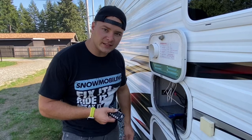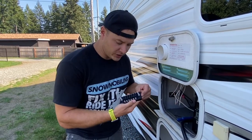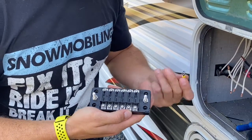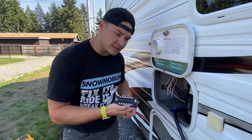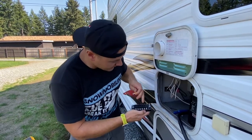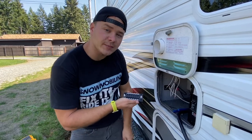Now that we've got everything disconnected from the previous DC bus, we're going to grab our new DC bus. One thing I liked about this is it shows you everything from positive to negative — negatives on the bottom and positives on top — so it's pretty simple hooking back up. These little terminals I have are for 10-gauge wire because that's what's coming from the battery, so I'm going to crimp these onto the end of that wire. I took the nuts off, put them over the top, and then I'll connect the neutrals to the neutral side and the hot lines based on the picture I took earlier.